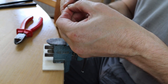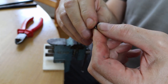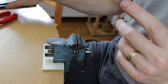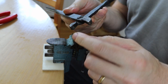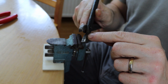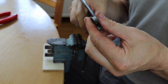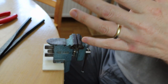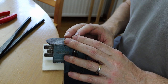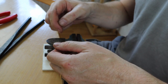But you do end up with a very nice result — that's the original side and that is the riveted side. So that works quite nicely. If you're going to be doing a lot of these, and you have this tool which has got a hole on both sides of it, either grind down one of these ends, or preferably if you have a friend with a MIG welder, just stick a spot weld in there and flatten it down — I think that will work extremely well. However as it stands, the tool they give you just doesn't do the business particularly well. I did try hammering it but the item is so small and you get so much bounce that it's very hard just to hammer the thing over.